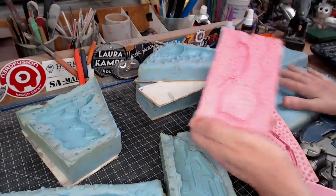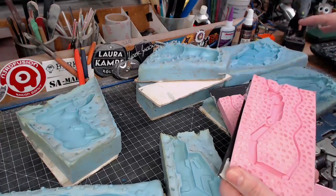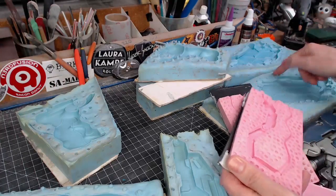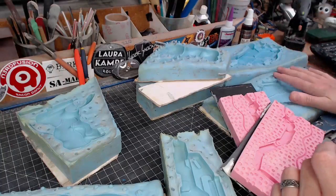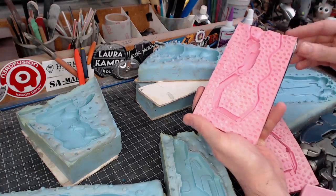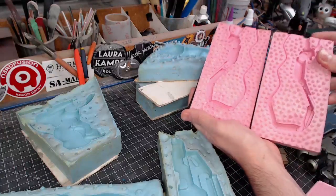So when I made this mold here, I didn't have a degasser to pull the bubbles out of the silicone while it was still liquid. Which means if I put this in a pressure pot, those bubbles will compress and it will deform the casting. So I can't pressure cast this. This newer mold was made, of course you can go watch the Mr. Handy video to check it out, but the silicone was degassed.